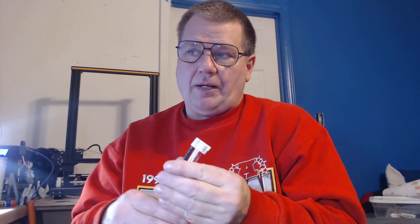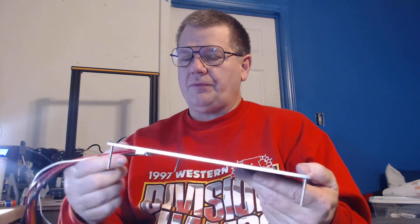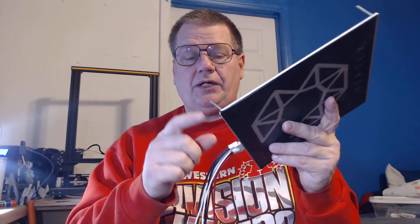Basically it does a 12 amp pull, and that's probably split 6 and 6, and this is 10 amps per connector right there — much safer. Now one more thing you've got to do, and there are several designs on Thingiverse: one of the problems that happens with these connectors is that the print head is always in a constant state of movement. The one behind me is probably moving right now. These wires are moving all the time — you need to get a stress relief, and you can print them off Thingiverse to mount it down here to keep these wires from moving around. Every time that moves it creates a little oxidization on these connectors — more oxidization, more heat. These connectors get all oxidized and it increases your resistance, which increases the heat, which in turn melts your connector.